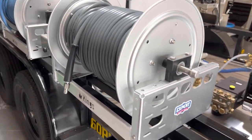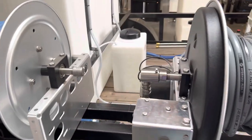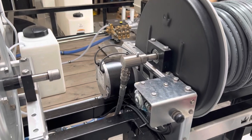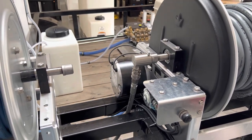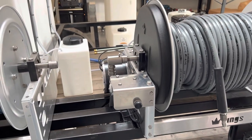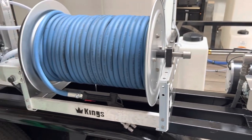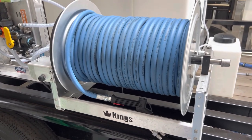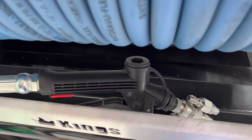This one will get a ball valve swivel. We do have one pressure washer hooked up to where it is running through the hose reel. You can snap in a downstream injector onto that as well — lots of different options as far as running the hoses on this. We have 200 feet of soft wash hose with the Suttner 510 gun with the stainless J rod.